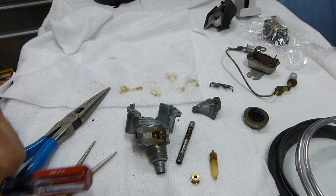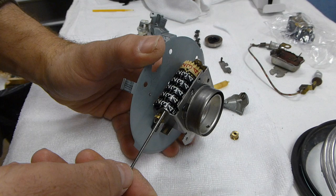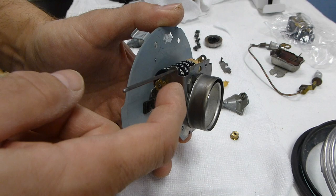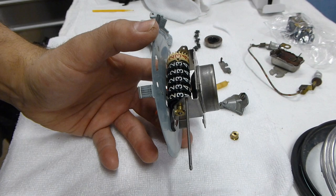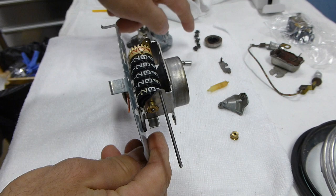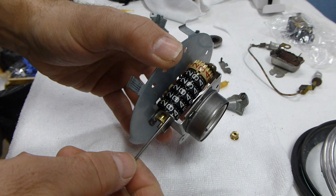I was able to get the little gears out that spin the odometer. The way I did that was I pulled on the end of the shaft on the side with a pair of pliers - gently, slowly pulling it back - then taking out one gear at a time. I've now spun the odometer back to about zero. What I'm going to do now is put the gears back in one by one, noting the order and direction they were in, and slowly push the shaft back in.